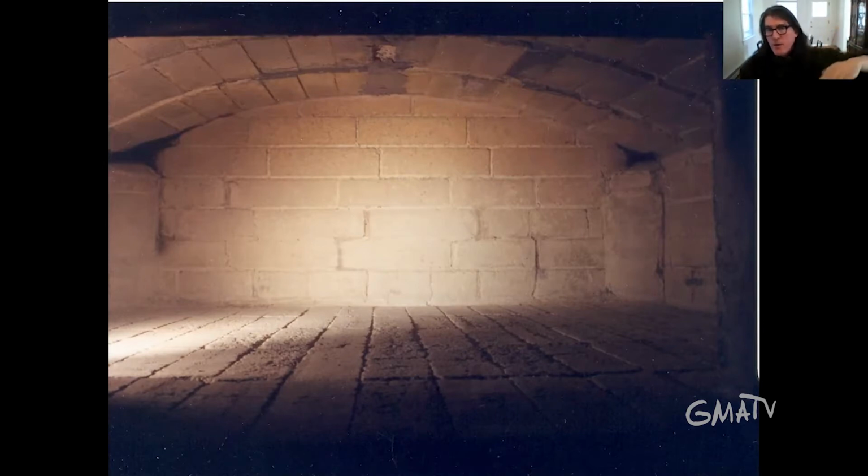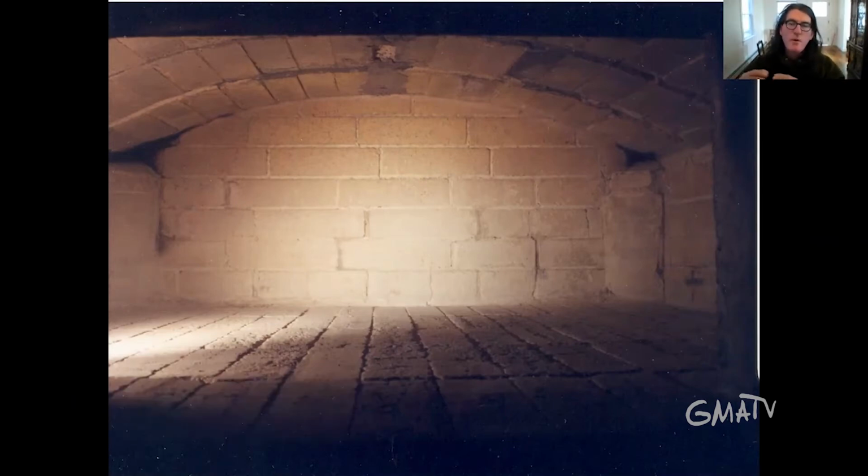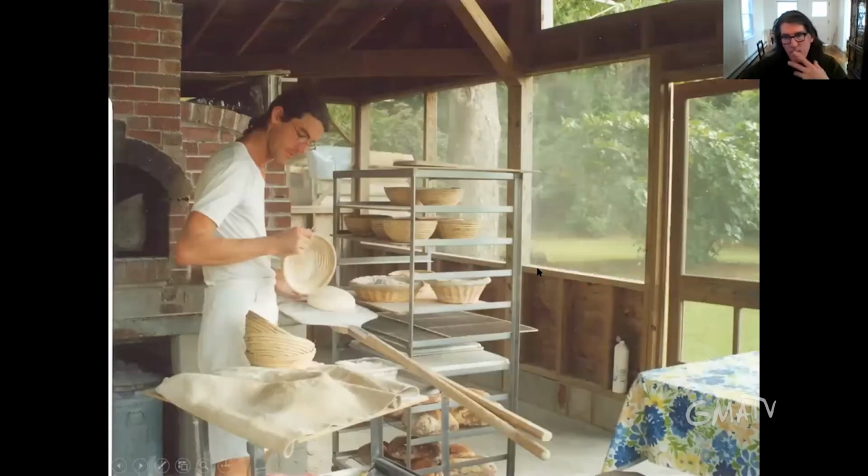So we're above baking temperatures and want it to cool slowly. I'll say, Jen said the next morning it might be 200 to 300 degrees. I think you can probably have it at a higher temp the next morning, just with firing schedules and maybe sustaining the fire. And we can talk about that more at the end if you want. But we have the ability to have that temperature be a little bit warmer the next morning, more than 200 to 300 degrees. At this point, though, we might be 700 degrees.